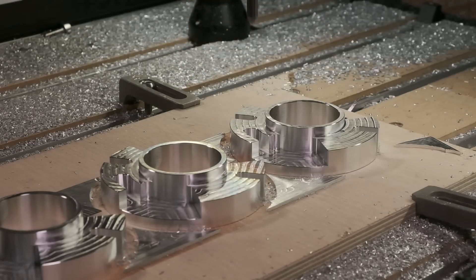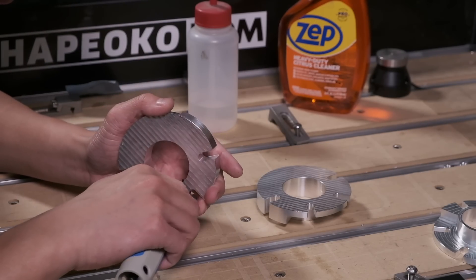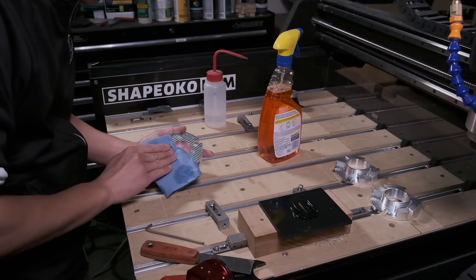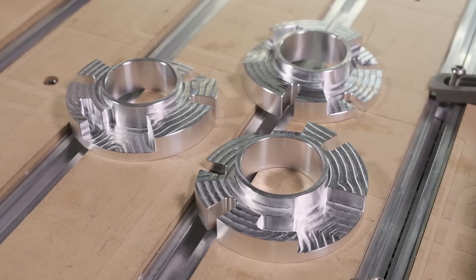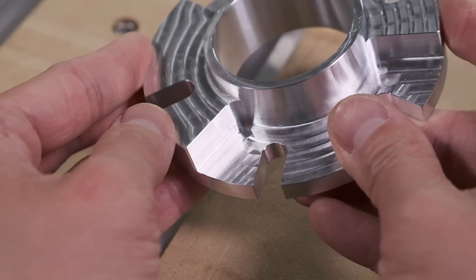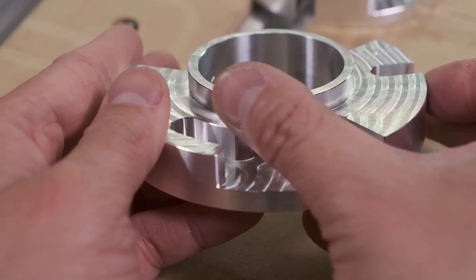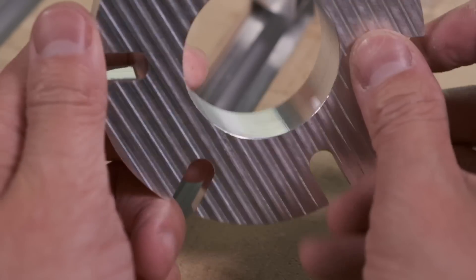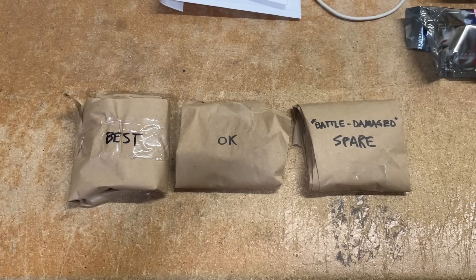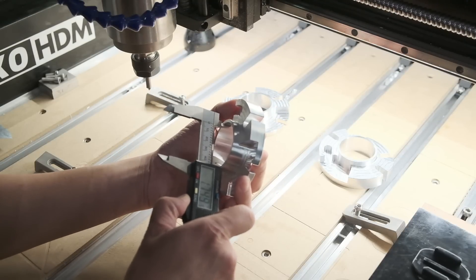And we're done — with the machining at least. With these parts and my setup, there was a tiny bit of misalignment in the indexing, so I had to touch up some of the more marginally chamfered edges on the bottom with a deburring tool. I also took some time to clean up some adhesive residue on the bottom of the parts. These three turbo encabulators took twice as long as I planned because I overestimated the abilities of double-sided tape and underestimated the thermal impacts of machining. But that mishap was a good learning moment, and it gave me a chance to properly chamfer the crap out of this part. The result is a pair of externally pristine parts and one part that I'm charitably calling, with air quotes, 'battle damaged.' Maybe Zach can scuff it up a bit more and apply some weathering effects to make it look like a salvaged Star Wars relic.